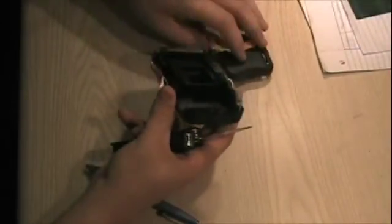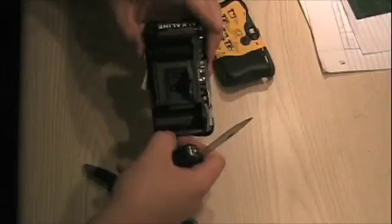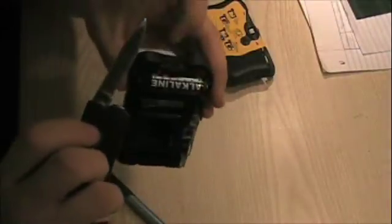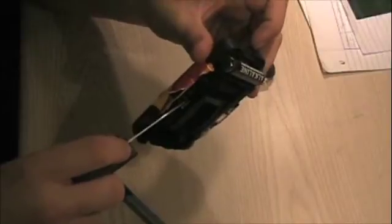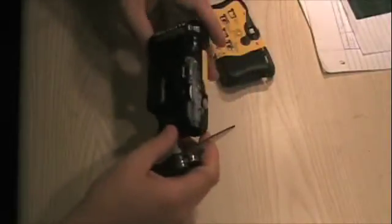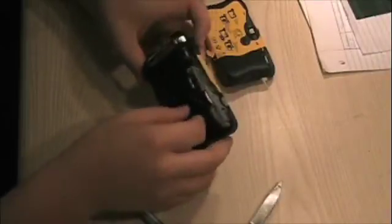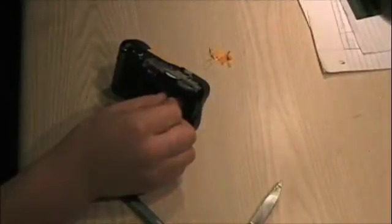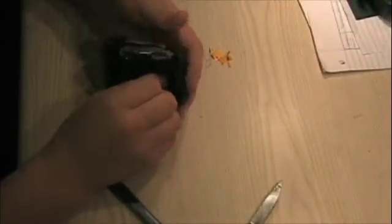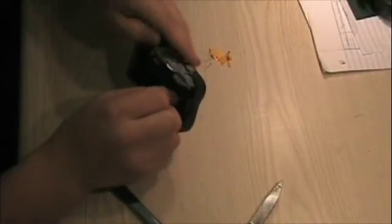Here's the back of the camera. You can see here's the battery — just the standard alkaline AA — and there's the capacitor. It's harder to see, but make sure you know where it is. Now, carefully rock this back and forth until you get it out of the case. Sometimes just pulling doesn't work; you actually have to stretch the case in some places.